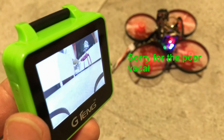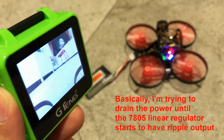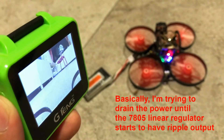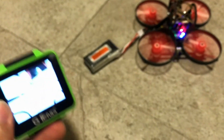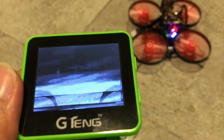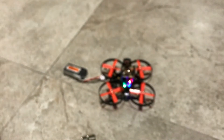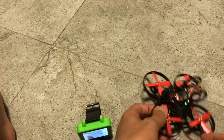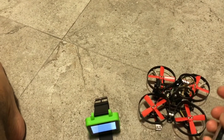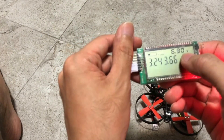Now I'm trying to drain this LiPo from 3.75V to the limit where the video starts to have lines, and then you can see how much boost is left in the LiPo before the video stops working. I'm going to get some lines now. So let's see how much voltage we have in the LiPo at this stage — 6.8, 6.9V.